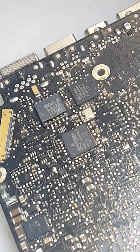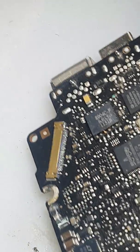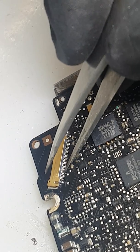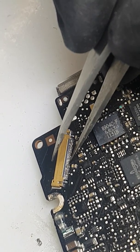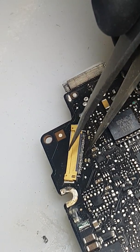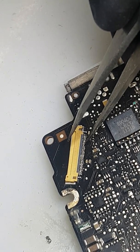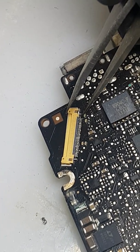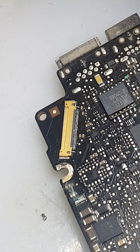Now time to test the points. We're going to simply take a tweezer and go over them very softly and gently. The one which moves will be the one which is not properly soldered. So let's check - looks like we just got one here that needs attention. I was expecting some more but I think we just got the one.